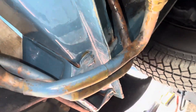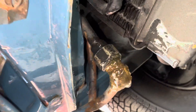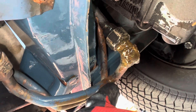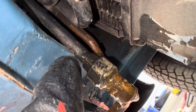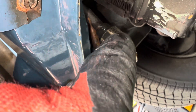That's not a real bad kink but it's a bad kink - there shouldn't be a kink right there. Can you see that? You should not have that. That's probably when somebody tightened it, they didn't hold it right and it bent on them. And we're gonna get some rub to look at right there where it's rubbing on the frame - that could rub through later.